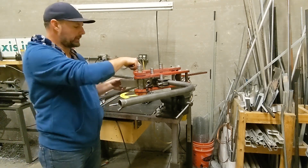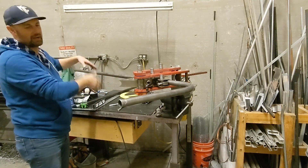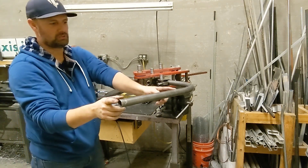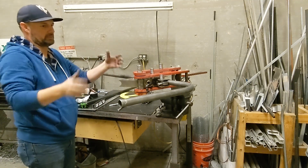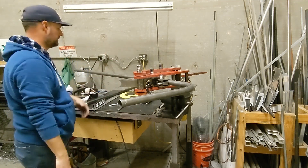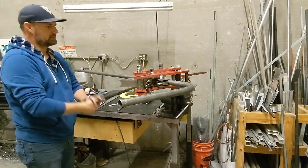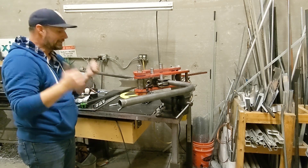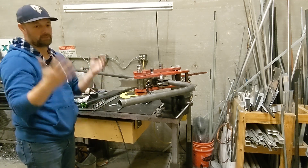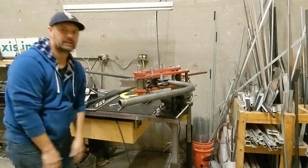So I'm going to do my next 90-degree bend. This tube's going to have a whole bunch extra — I'll just leave it on there because I left this tube a little bit long. That way I can put everything on the table, get some accurate measurements, make sure everything's cut even and flush. Then I've got to get the main hoop done, take everything home, and cut and weld and cut and weld. That's my month. All right, that's all I've got for today. Hugs and kisses. Bye-bye.